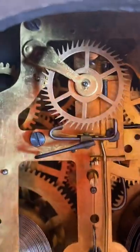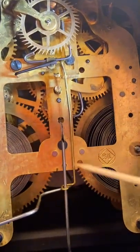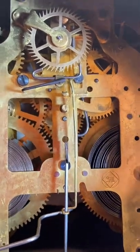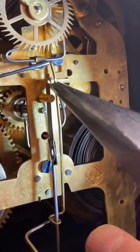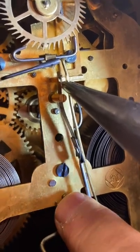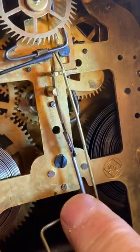It's real easy to put a clock in beat. First, make sure it's level and in good condition. This wire right here is the verge wire — it's brass and generally very soft, so you can bend it. We're going to use a pair of long-nose pliers, grab right about here, keep that steady, then with your other finger bend the wire in this direction.